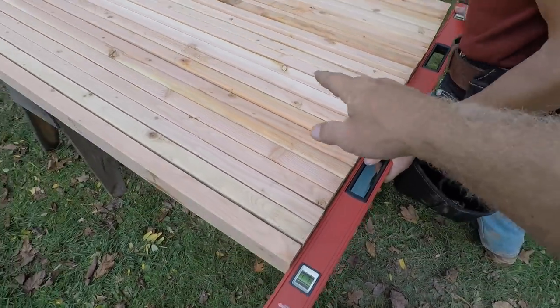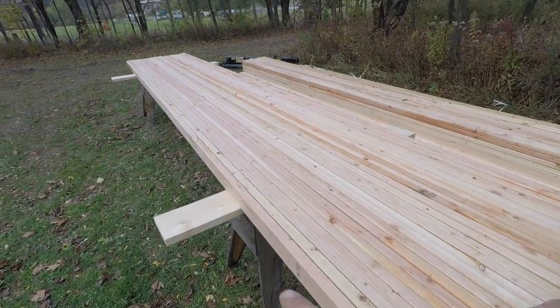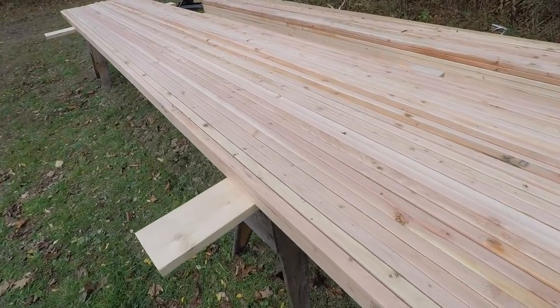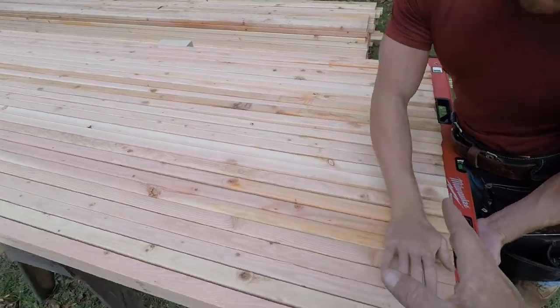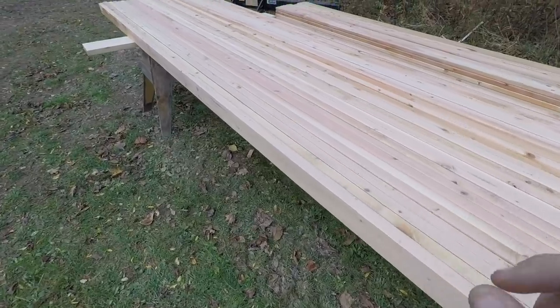And what we do is we lay them all out at once. So this is one bay. This is up and over the roof from one fascia up to the peak and down. 26 purlins. Every 2 foot we will put this. They will stand on edge. And we will pre-drill these all so that when we get up on the roof, we know exactly where the nails are going and we don't split any wood.